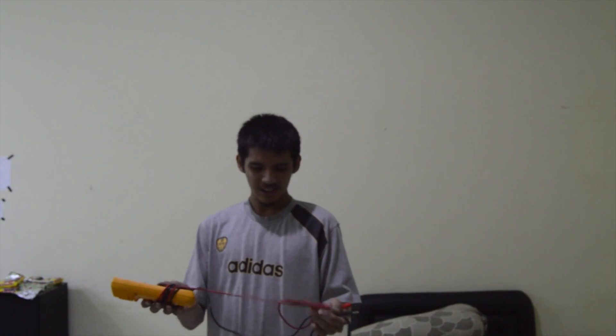I prefer you use the banana plug cables instead of the test leads for higher current. Because if you do have an extremely high power subwoofer, you might need to bypass the fuse inside of the multimeter itself. You're going to blow these little test leads if you put 40 amps through these little cables, even though it says 480 on this cable.